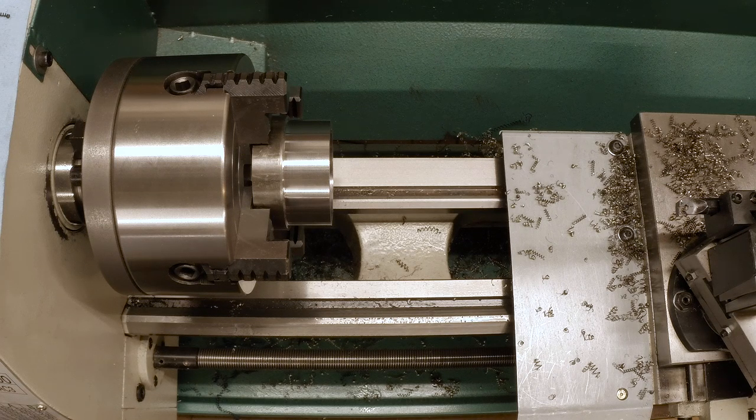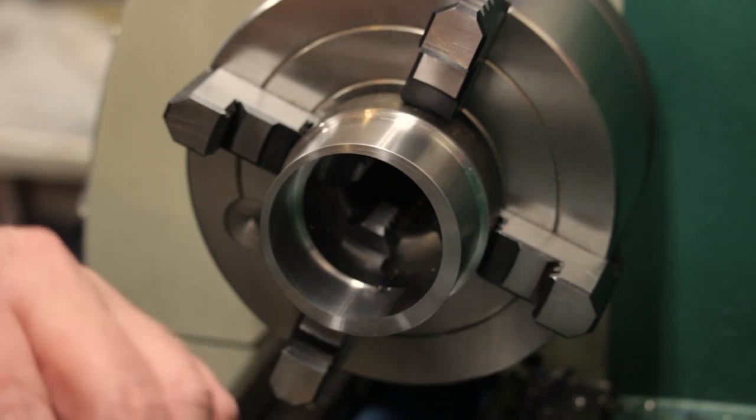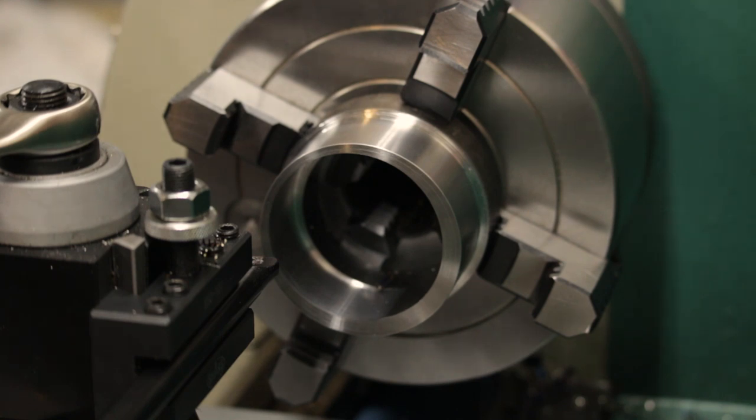So I'd like to land that one pretty close to being right on the last cut so that we can get a good surface finish on it. So I don't think I want to go clear to 25, but if I take, so if I got 56 to go, that's 18 and a half. Times three. So let me take two passes of 18.